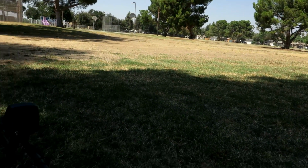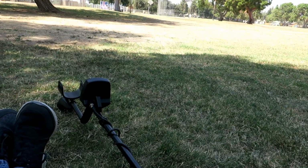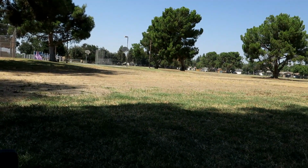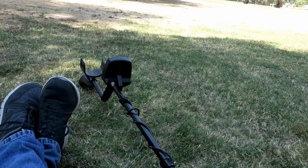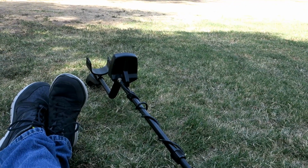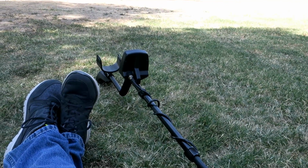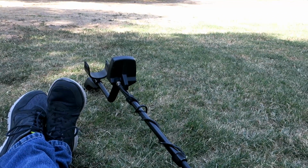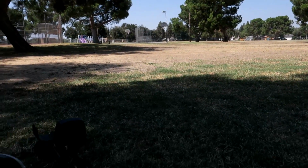A quick threshold lesson for you guys as well. You don't want that threshold to be wobbly. A lot of guys on a lot of machines, 50%, 60% is too high. I'm not kidding. When I go gold prospecting and I'm listening for peaks or drops in that threshold, I'm running like 20, 30% on the G2 Plus or the T2 or the F75. I use all three of them for prospecting, and they have found gold. So I'll tell you right now, less is more.